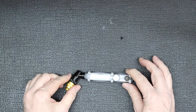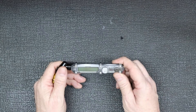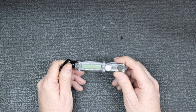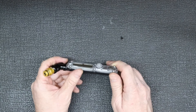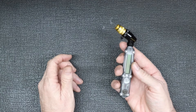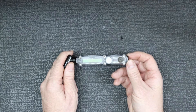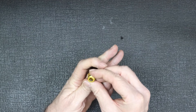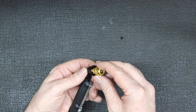The instructions tell us straight away this gauge has 1.5% accuracy. It can go up to 350 PSI and 24.1 bar, which is pretty extreme — I'm not sure what you'd be testing at those pressures, but that's dangerous stuff. The reported weight is 60.9 grams and the dimensions are 150mm by 149mm by 22.8mm. It handles both Presta and Schrader valves by taking the top part and switching it over.